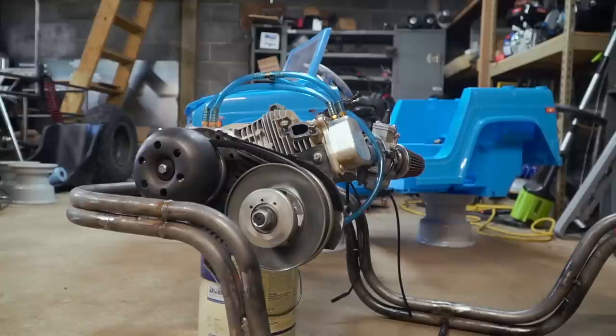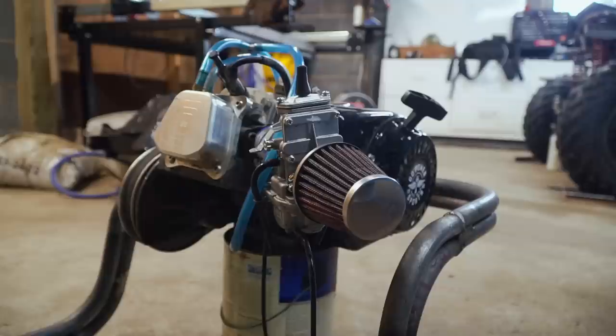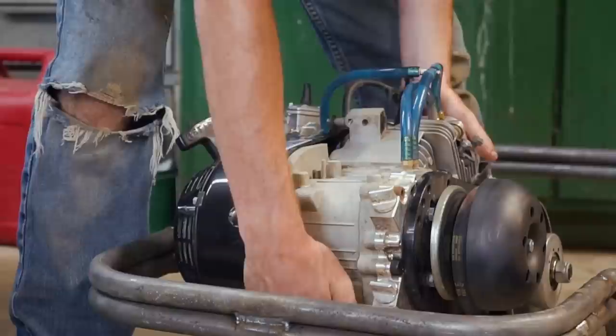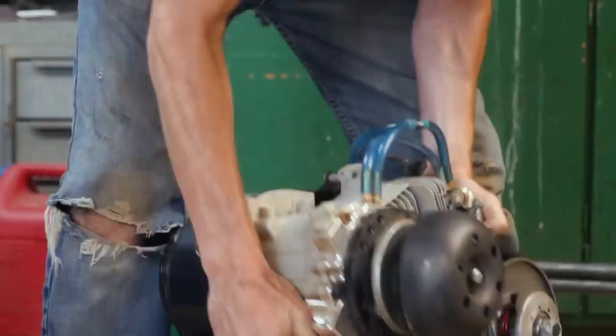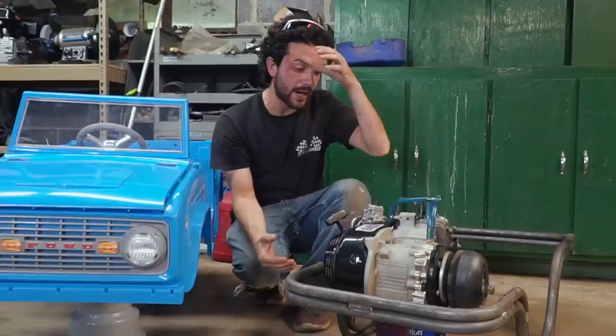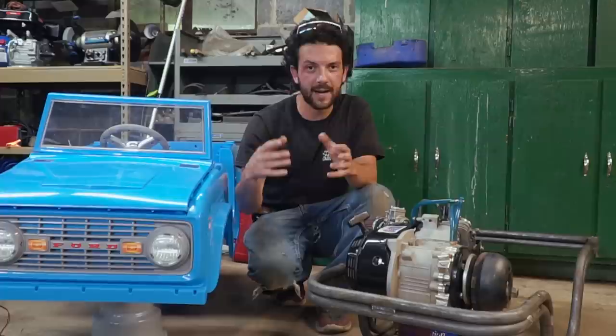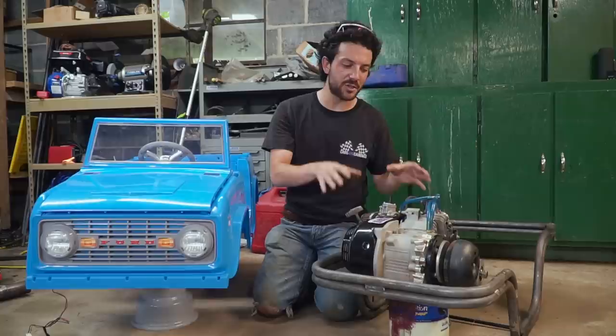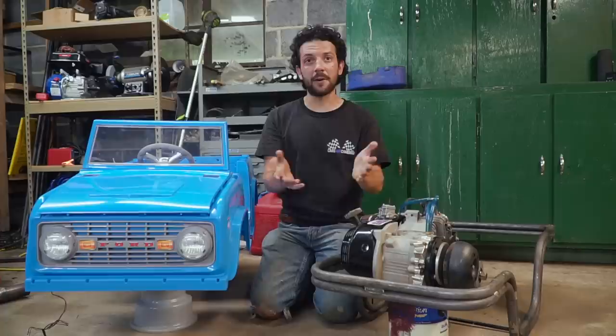We are going to be using a Tillotson 228cc engine from GoPowerSports.com. We chose this engine because it's very stout for its size. It's claimed to make 23 to 24 horsepower. It revs to like 8500 or 9 grand. It's very lightweight and the fuel consumption is really good too. Maybe 35, maybe 40 pounds. Look how compact it is — it's going to fit right in between our frame rails. We should be able to make it fit under the hood with no issues at all. The whole goal is to keep it lightweight, because while this is a decently powerful engine at 23 horsepower, if we add a lot of weight this thing is going to get slow, and we want it to be fast. You can check out these parts at a link in the description of this video.